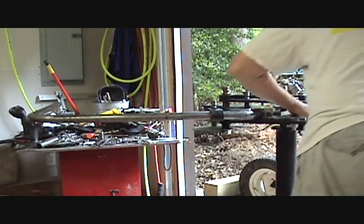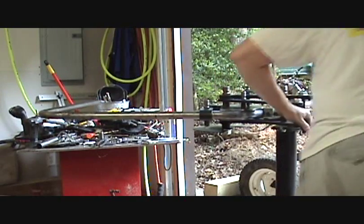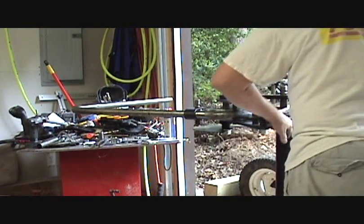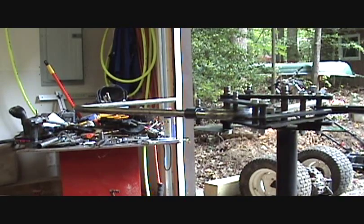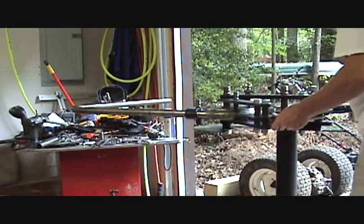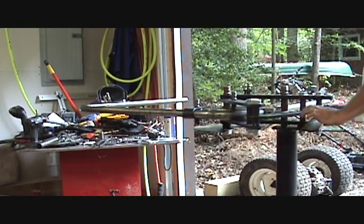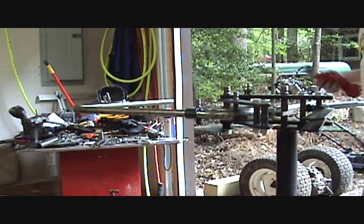I'm up to 48 degrees, 55, 62, 70, 78, 85 — that's about 93 there. I'm going to overbend it a little bit because the metal has got some memory and it will spring back a little bit. So I'm going to go up to about 94, get my die pin out, unload the catch bar, and that's it. That's all there is to it.